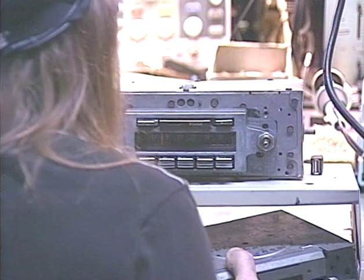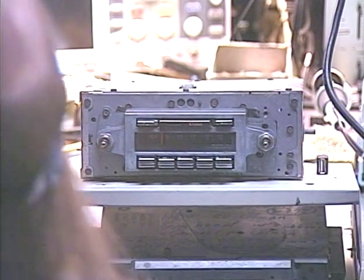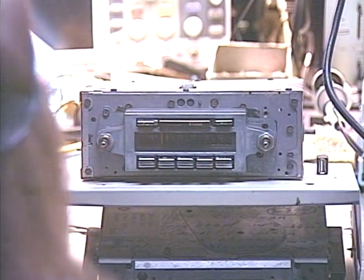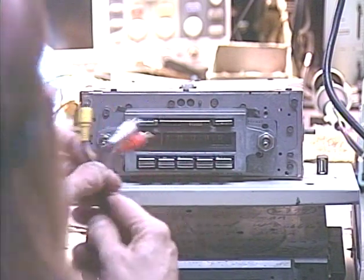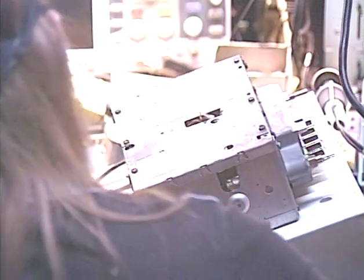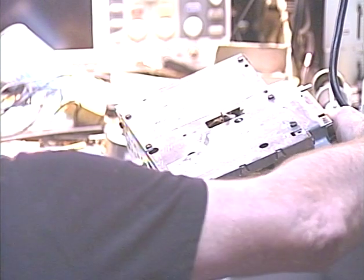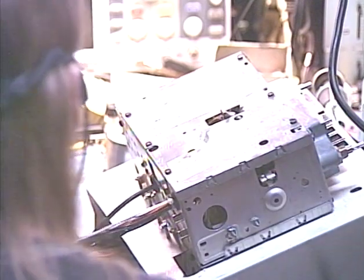Let's go ahead and hook this stuff up. The 8-track now just has a hot new ground wire and RCA jacks on the back. We're going to use a three-way RCA cable with red, white, and yellow connectors to match the connector colors on the units. It's extremely important that the yellow connector only goes into the yellow RCA jacks, otherwise it's going to damage the unit. So we've got the red going to the red receptacle, white going to white, and yellow going to yellow.